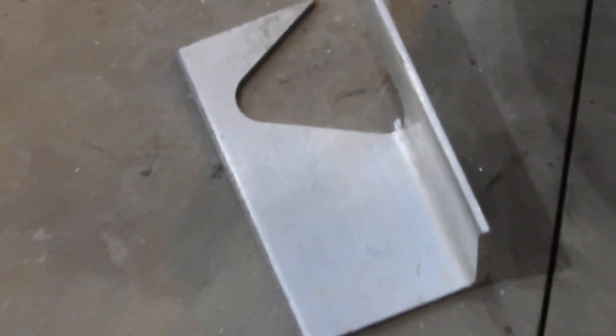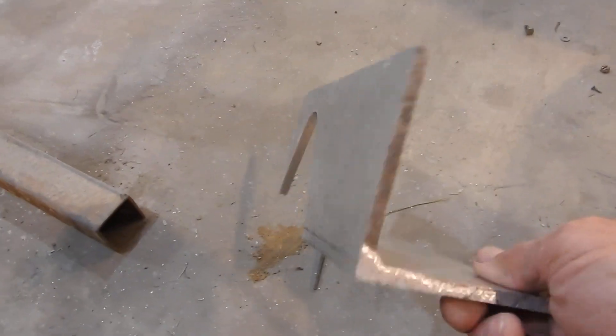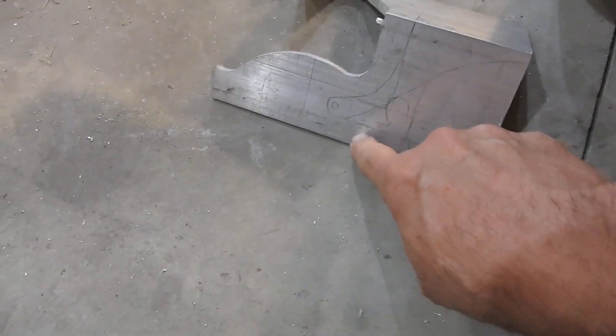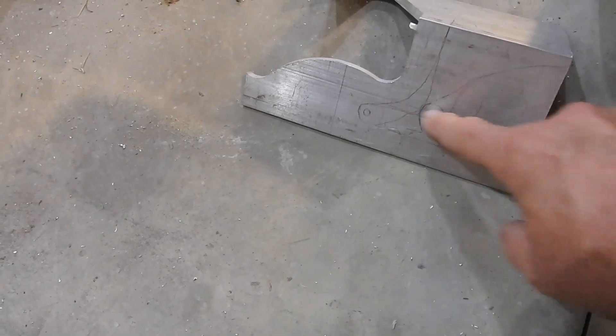I've got to do a little clearance work in here to get the bolt back into this thing and finish it up. The other side is the same way, same problem — but they're all hooked up. Here's a chunk of four-inch, quarter-inch-thick aluminum stock. I can get one piece out of that. I was kind of drawing a sketch here of the idea — this is where it's got to hook up to, so somewhere in here it needs to be two pieces to adjust this vertical position.